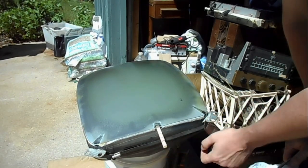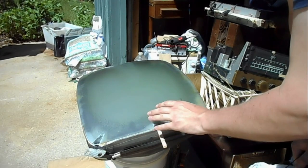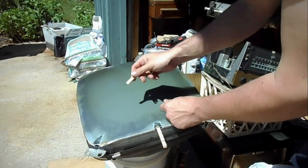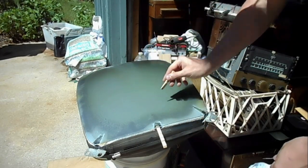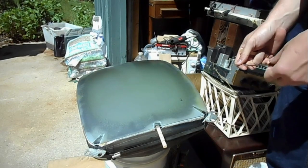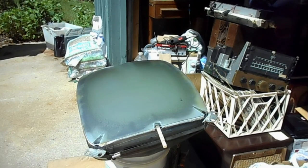If you start banging on these wedges, you'll crack the safety glass, and then getting it off becomes a very hellish procedure of taking screwdrivers and hammers and heat guns and chipping and melting and prying, and it's not fun. You don't want to go there. So I'm going to finish getting all of this wedged up and continue from there.